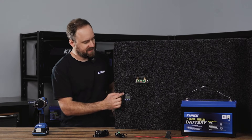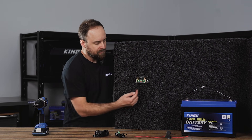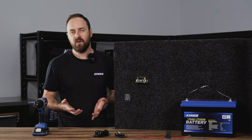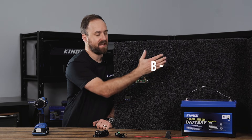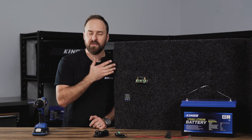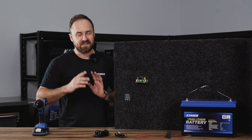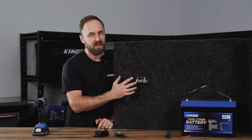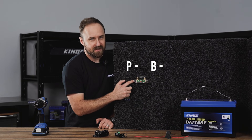The display is mounted and the shunt is mounted. There are two different ends of the shunt — as outlined in the manual, you connect one end directly to the battery and the other end to all of your chargers and loads. The way I like to think about it: B for battery, so B negative goes to the negative terminal of the battery, and P negative is product negative. You're connecting all your products to this end — camp lights, camp fridge, 12 volt oven, DC-DC chargers, solar regulators — anything you want displayed and calculated by the shunt needs to pass through it.